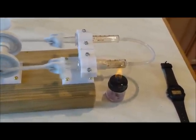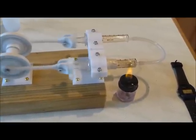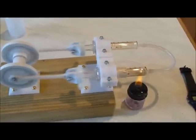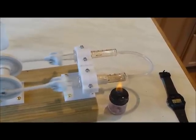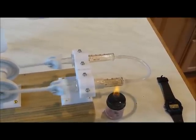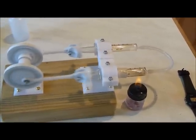Around about minute five it should be getting more into thermal equilibrium. One of the things is that the pillar for the flywheel is not really strong enough — it is vibrating forwards and backwards and that is lost energy. This is running quite well but it will go a bit faster. This is two minutes now. The small flame also prevents heat traveling along the syringe into the plastic support. I've got PTFE tape wrapped around the syringe as a bit of heat barrier.